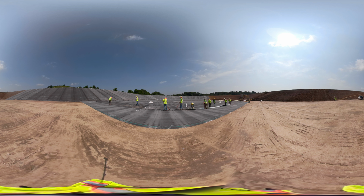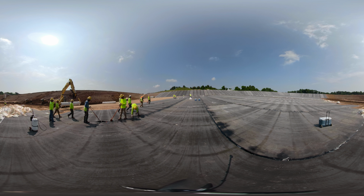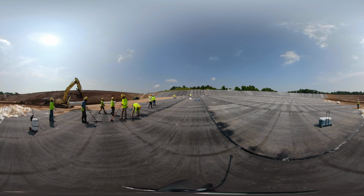Following the peeling of the plastic cover, you will see two technicians in the process of welding this geomembrane. As with all geomembranes, you have three main parameters in producing a quality weld: heat, pressure, and speed. In this case, all of these are manually controlled, with no automated welding machine approved at this time. The heat is provided by a propane torch, which is effectively at full throttle.